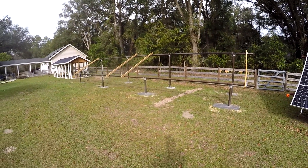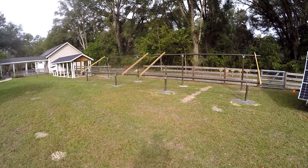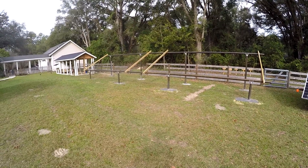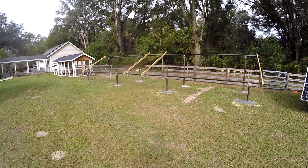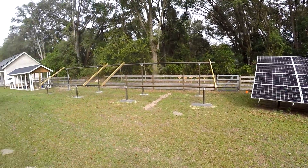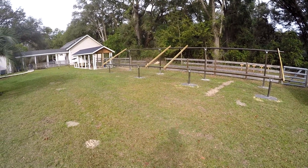So most people don't do the wind loading and engineering on their racks and they end up under-building them. Just to put it in perspective: this is 18,000 pounds of concrete holding this down, and that's based on the calculations. That's for Florida — we do have hurricanes — so I had to go to 120, 130 mile an hour winds. It takes 18,000 pounds to hold that down; that's what the uplifts are. This one was 9,000 pounds. That's 300 bags of 60-pound bags. Don't think that a couple of bags of concrete are going to hold down an array like this.